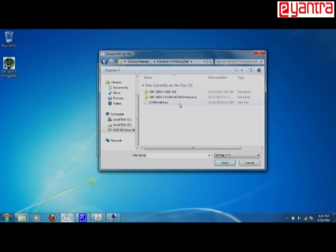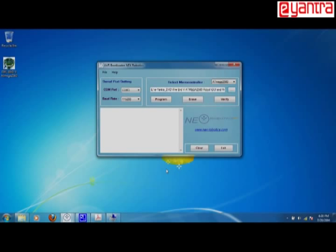Firebird 5 Atmega 2560. Then you have a folder called Firebird 5 Atmega 2560 firmware. So click to open this. Then you will find USB GUI firmware. Now inside this, in the default folder, you will find a .hex file. So click on it and then click on open. So once you have opened it, you have browsed for the program successfully. Now the next step is to program.